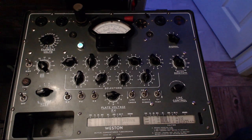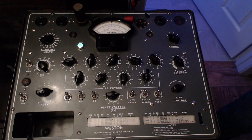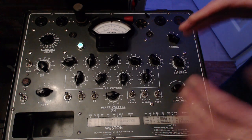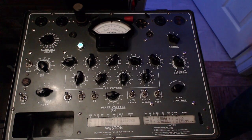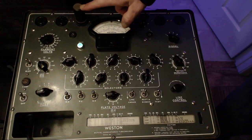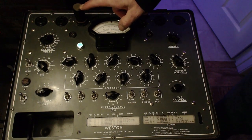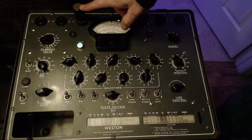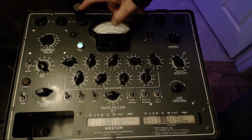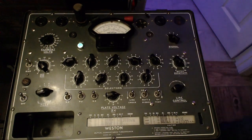So just like in computers, chip manufacturers manufacture chipsets, and you get all these chips that all work together quite nicely. You buy the set, put them in your computer when you're a manufacturer. Same thing with tubes. Tubes were kind of issued, maybe not so much as a set, but there are certain groupings of tubes you always find together, like this one, 6SQ7, 6SK7. Very, very common tubes in these radios.